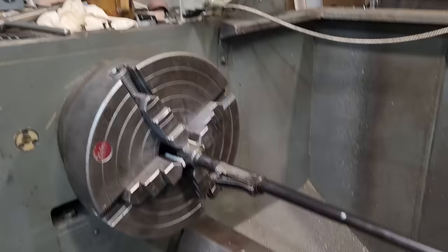The bore is running straight, the drill bit is not drifting. We've slowed the machine down as slow as it'll go — about 40 RPM. This reamer is about 5 thousandths of an inch bigger than the lands, which will let us peel the lands off and leave the bottoms of the grooves. We have a Sharpie marker line drawn on this reamer so we don't go any deeper than that, since we don't have digital readout on the tailstock.